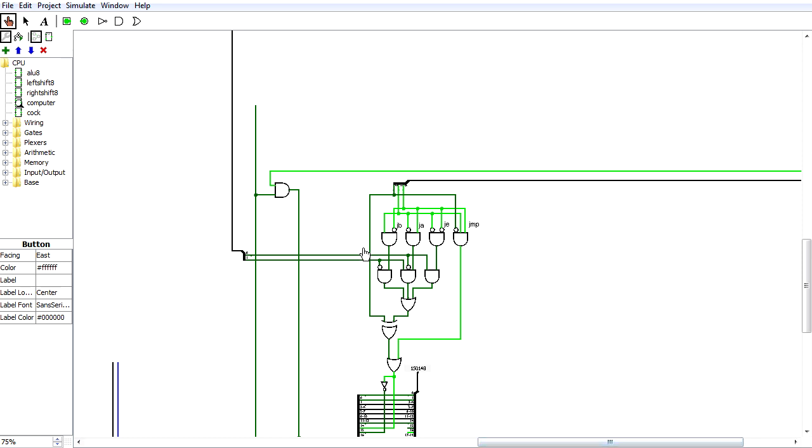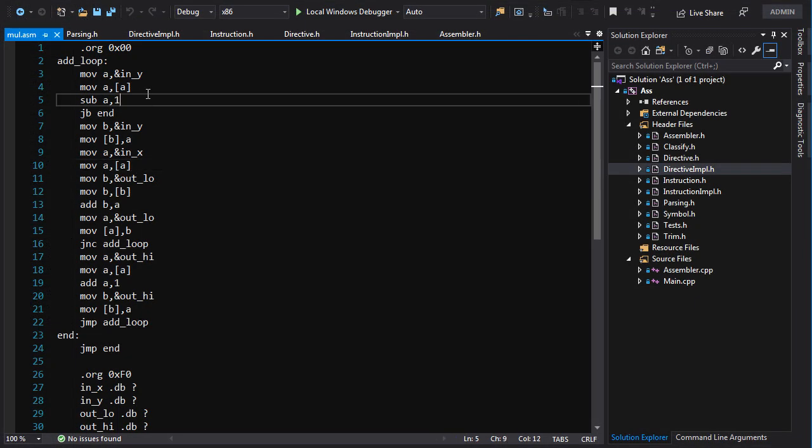And I think what I want to add to the CPU to start off with, like this is super annoying. Every time I want to load from a memory address into a register, I've got to load the address into the register, and then I've got to indirectly load from the memory into the same register. And storing into a memory location is even worse because you have to use both registers to do that. You have one register that is going to be the data that you want to store, B, and then you have to use A as the address to store into for the indirect storage. So you have to have both registers free to store a single value, and that can be pretty limiting, can make your life harder for programming, can make your programs longer, can make them more difficult to read.